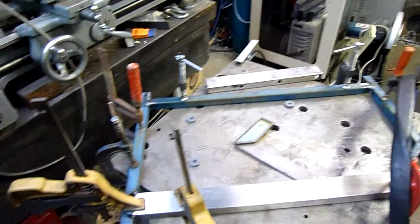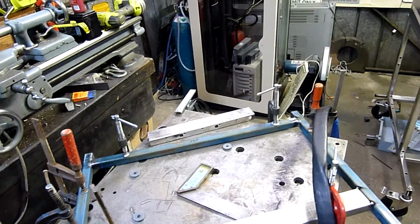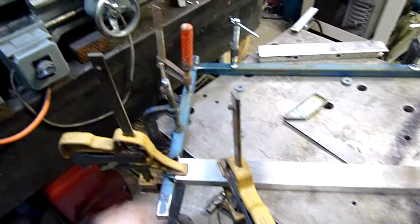Like, just make it strong, make it so I can attach the computer case and then put it on the wall. So even if I just weld all the downs, the verticals, and then pull it off the table and see what it's like, should be strong enough. If I weld all the horizontals, I could warp it a bit more than I already am.